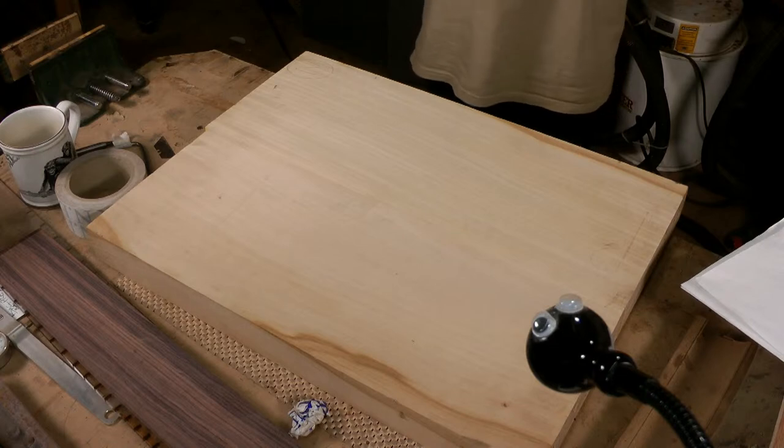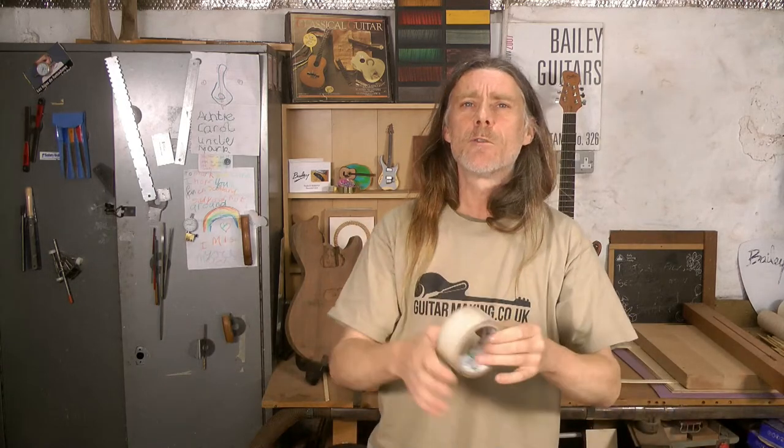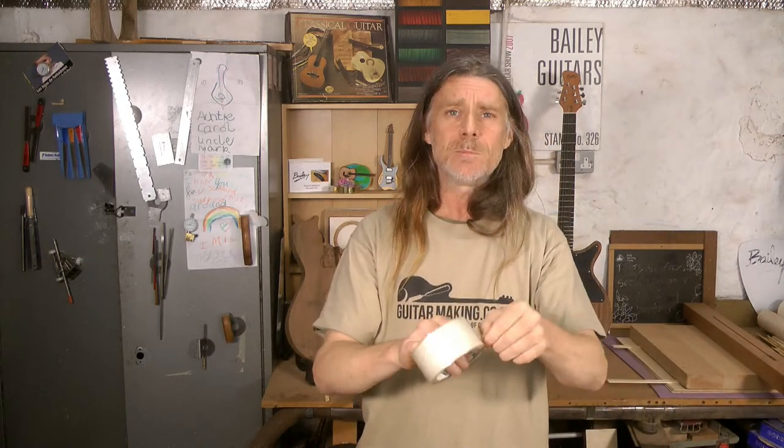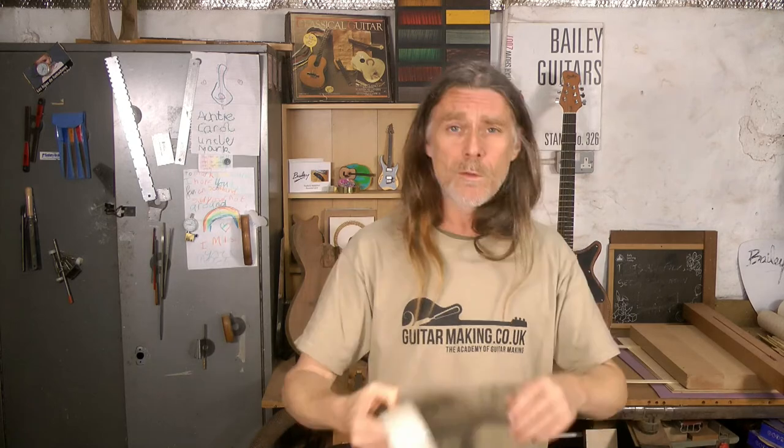If you want the ins and outs of it, then you should really sign up on the course. But what I will say is you can de-tack it. So if I'm putting this onto a soft wood like the front of an acoustic guitar, then what I would do is de-tack it. You just take a bit off, you stick it on your t-shirt, and then you lift it off. Or you can stick it onto your bench or any piece of cloth. You're basically de-tacking it, so it's not quite as sticky as it was before. So if I'm putting it onto softer woods like spruce acoustic guitar tops, or maybe even mahogany, you might want to put a layer down where it's de-tacked first, and then you can put a full strength layer on top of that. So yes, it can damage the wood if you're not careful with it. I'll go through all that in detail on the courses.